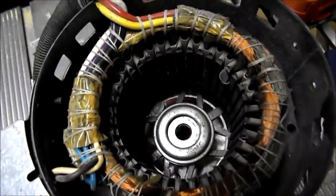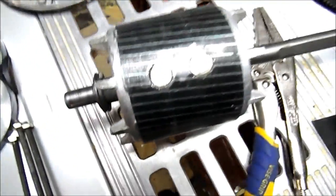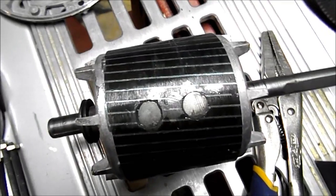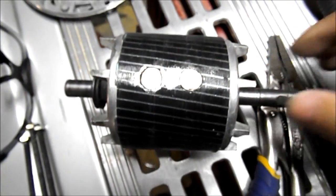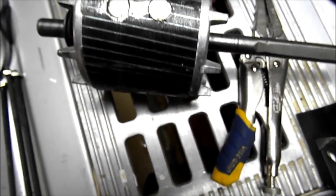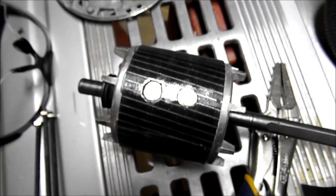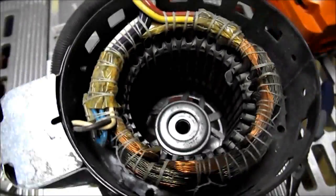The problem was, after I got it in, my coils and my magnets do not line up. What I should have done was put four more locations for a total of 16 magnets. But the only way I could do that now is to break those magnets or try to mill them back out. And since I don't have access to a milling machine anymore, I guess I'll have to rewire my motor.